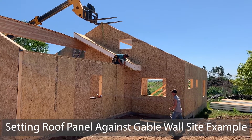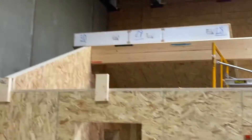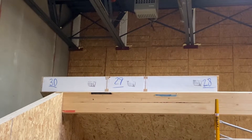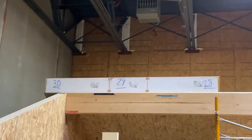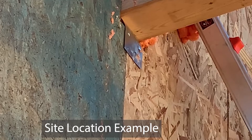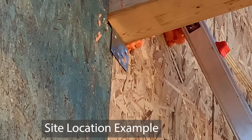Then it's just a matter of sliding the panel up and down to get it into the right position. Hopefully you've squared up and braced the beam so it's not snaking all over the place — you can use the V at the top of the beam as a guide. A lot of guys run string lines from one end to the other as a reference, set low on top of the beam, to judge the distance as you set panels and identify critical dimensions.